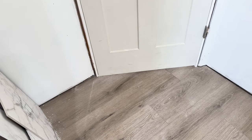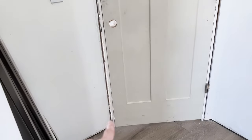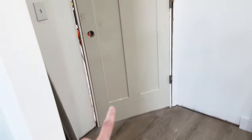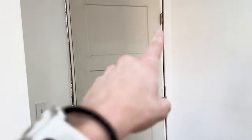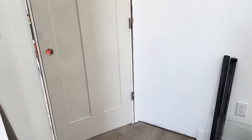Now look at the top — we want to get that gap to be consistent. One thing we're fighting against that you can't tell just from the camera: there is a big hump right here in the floor. This whole house is built out of stone and right here is our middle structural wall, so there is a stone structural wall underneath that gave us a little bit of a hump we couldn't do much with because of movement over the years. We're going to trim this side down just to get it a little more consistent, but we might leave it slightly out of whack because of what we're fighting against. But starting with that wall made this so easy — now we're going to make this as aesthetically pleasing as we can on the top and the side.